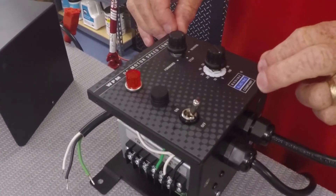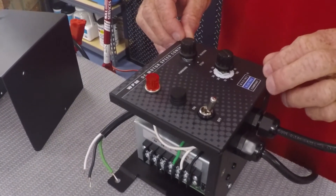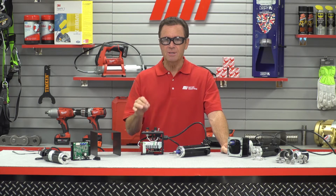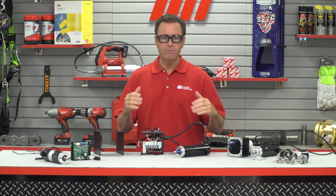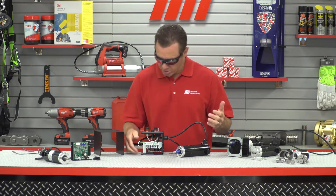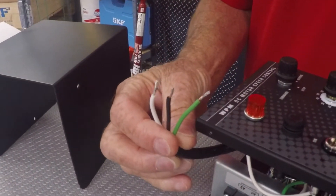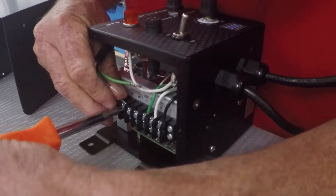This drive system shows a Bodine model 0794 NEMA 1 enclosed speed control that operates from 115 volts AC and provides 0 to 130 volts DC to the gear motor. We've already removed the control cover from our model 0794 to expose the location of the electrical connections. We simply connect the gear motor to the control by connecting the positive white wire to the A2 terminal on the control.